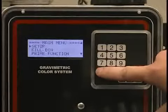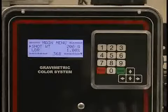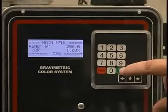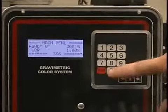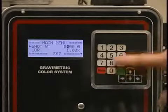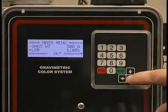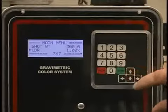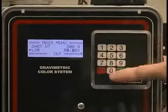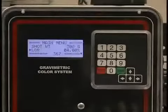Back out to my main menu. Now it's asking me for shot weight rather than pounds per hour. I enter the shot weight in grams: 3, 0, 3, 0, 0. Then page down to my letdown rate. I want to change that to 4%. Enter: 0, 4, 0, 0. Enter. Turn the unit on. It begins operating.